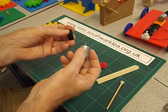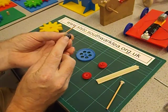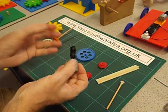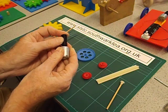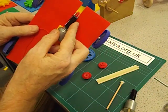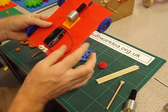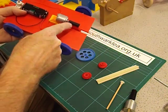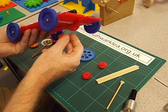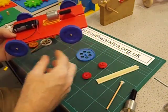I'll be talking about that more later on. We use an adapter — they come with a four millimetre hole and I've pushed an adapter in to turn the hole into a two millimetre hole, and then we can push the worm gear onto the motor. All the things I'm showing you are available from my shop. Here in this gear-driven buggy you can see the motor with its worm gear meshing with a spur gear. If I turn it by hand you can see the spur gear turning, and if I switch it on, the worm gear is just a blur it's turning so fast, but the spur gear is still going fast but slowed down a lot.